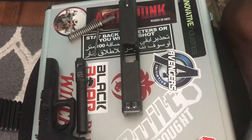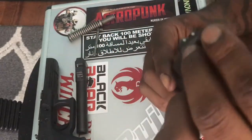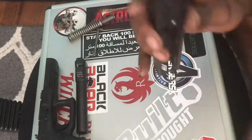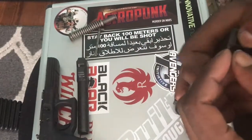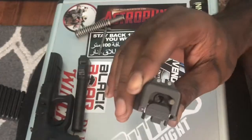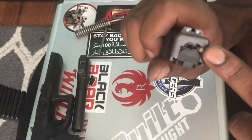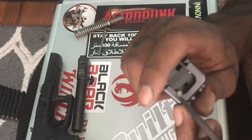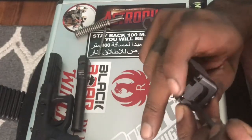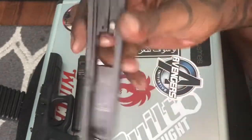Limited friction — it is an awesome firing pin. Take your firing pin spring and housing and drop it right back into its normal location. Take your back plate cover and push down on that plastic housing for the firing pin with your thumb, then slide your back plate over the plastic housing with the crucifix for your firing pin. Slide that up to where your spring is. That's when your punch comes back into play — compress that spring without firing it at yourself, and snap it right back into place. Boom — firing pin complete.